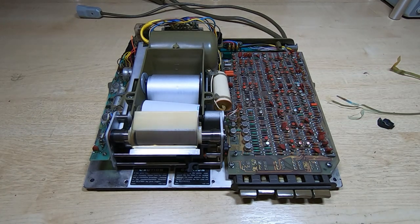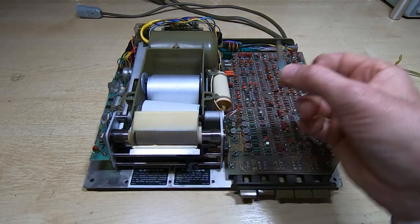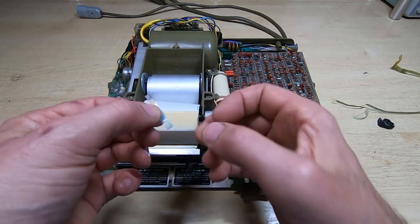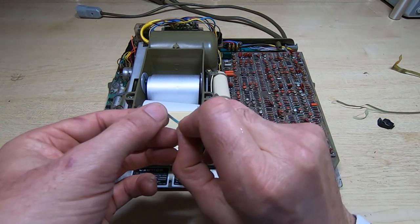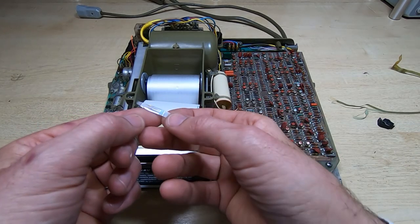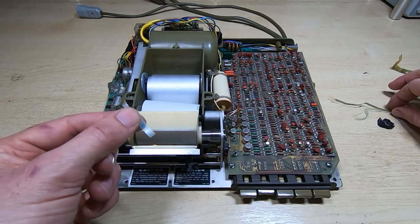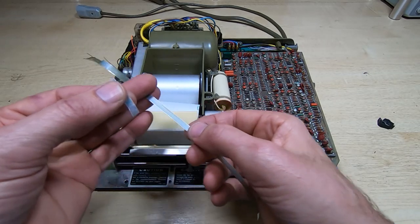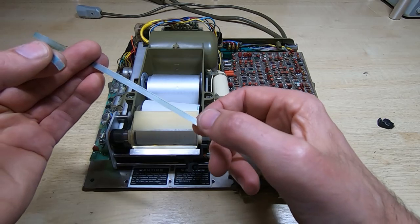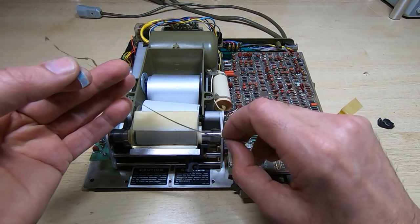I have dismantled this. It wasn't in two pieces. I actually cut the end off, but it wasn't making contact all the way along. Some had separated where they contact the tungsten, so you've got the other end of the tungsten in this section of this conductor. And some of the conductors in the cable had failed in other places. A lot of corrosion in this cable, there's a lot of green all the way down, and some of the actual conductors had failed further down.